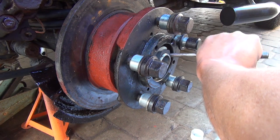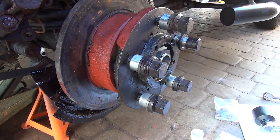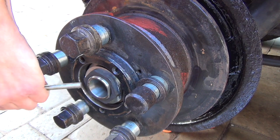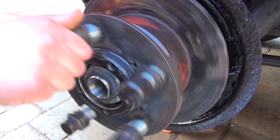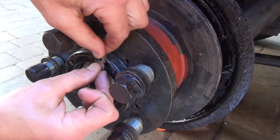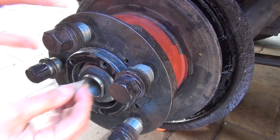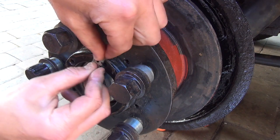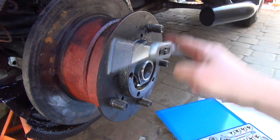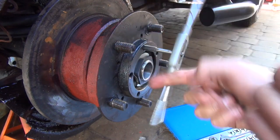The tab washer needs to be bent down on one side to hold the bottom nut in place, and on the other side bent up over the lock nut. Be careful not to score any of the faces that will take the gaskets. Checking everything spins nicely — looks much better than the one that came off. I should have done this originally. This is also clearing out the holes by tapping out the thread lock — I should have done that prior to fitting.